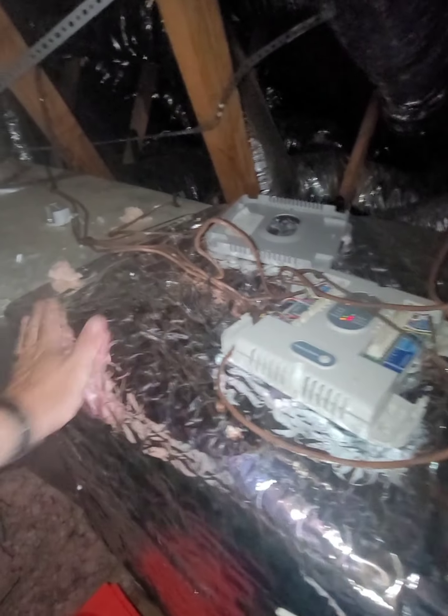The line set looks good — a little patinaed for some reason, but looks good. Let's see if we can map this out. We've got supply going into the duct board. This is bubble-wrapped by the temperature of it — it's losing more air than it's retaining, so that needs to go away.